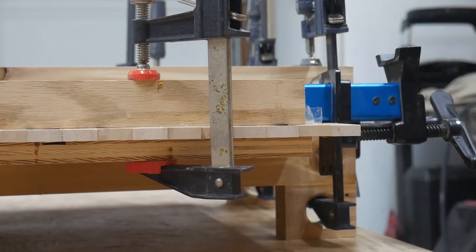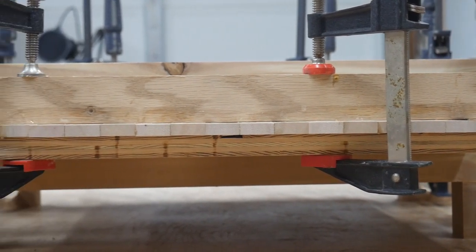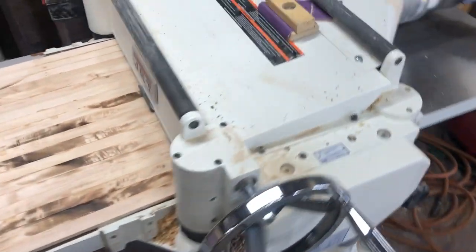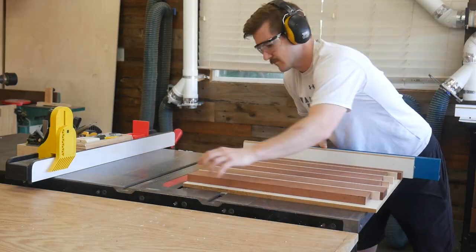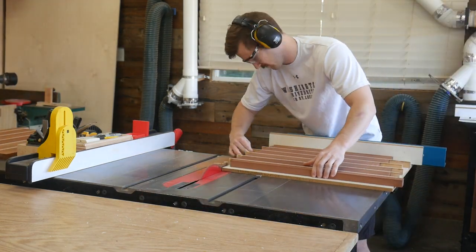The other thing I did — which you'll see — is I made a couple of really nice calls knowing that because this wood is so dense and I don't have a drum sander and was going to have to do all this sanding by hand, I really wanted to make sure that the glue-ups were as flat as possible. So taking my time with that made a huge difference, because the sanding process, although difficult, did go a lot quicker as a result.